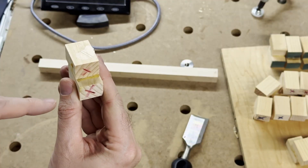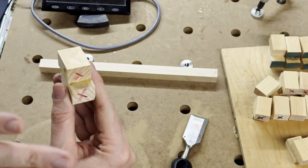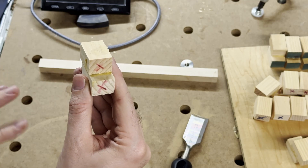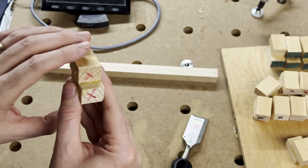We're right at about 400 pounds there — I'll let that sit overnight. I noticed there's a little bit of glue squeeze-out right here, and as I'm trying to apply load evenly I'm worried that squeeze-out is going to get in the way and kind of unbalance things, so I'm going to chisel that out on all of these real quick.